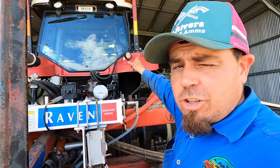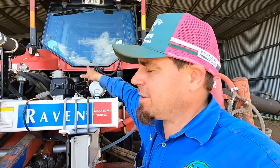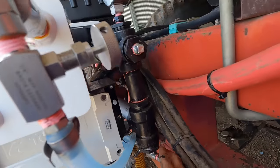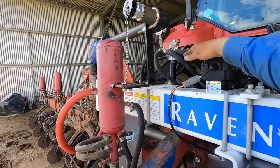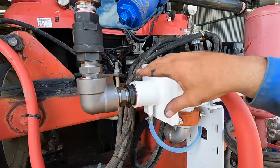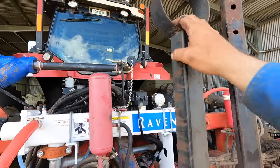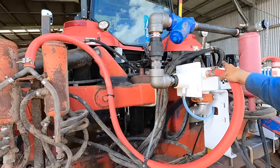We've had our boys from Palumbo's - Bricey - out using our Topcon screen, and we've just run an ISO cable through. Theoretically we'll just be able to plug that into any of the other tractors - the Cat or the Steiger, not that it's got linkage. Under here we've got our flow meter - it's stainless steel. Over here we've got all our bleed valves, pressure gauges, and then our distributor head. Normally this runs north-south on a pull-behind machine but we've run it east-west, so we got some 90-degree fittings and had a high-pressure pipe made up to bring the hose into the center.